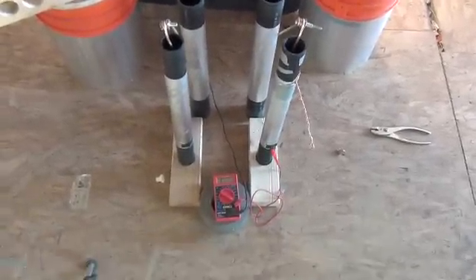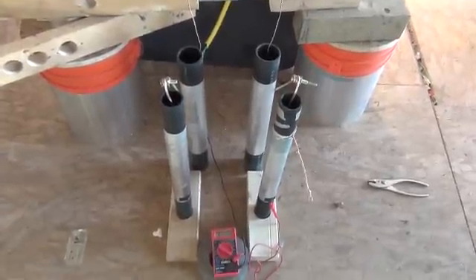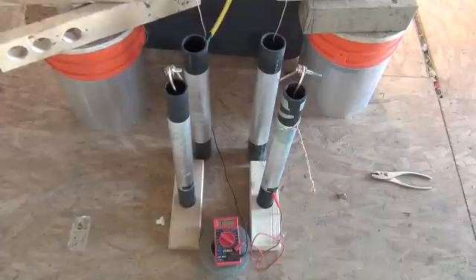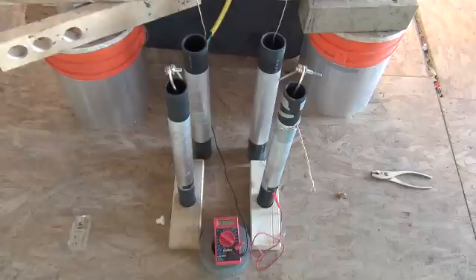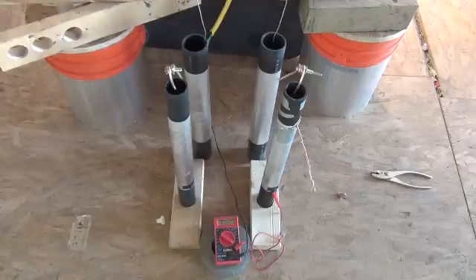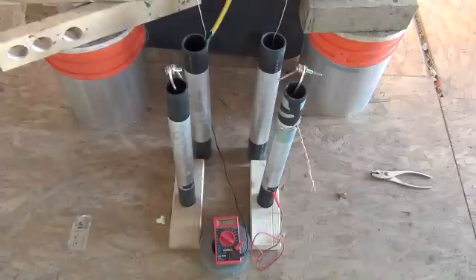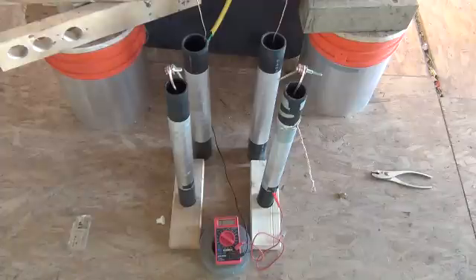Alright, so I've taken just a second to look at those films. Here's what I've come up with: I saw some spikes throughout that whole long progression — some of those spikes said 19 amps, now whether or not they really are that remains to be seen. Our average peak voltage was 33 volts — that's 627 watts of potential power if everything's rating right. On average we were between 5 and 7 amps. Dropping that 33 volts down to 30 volts with some loss, with 7 amps that's 210 potential watts, and with 5 amps at 30 volts we're talking 150 potential watts.